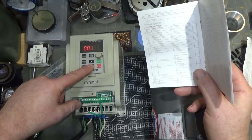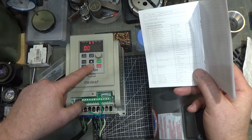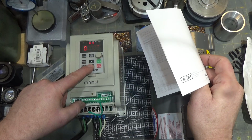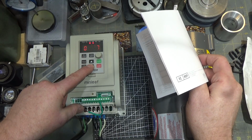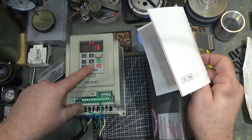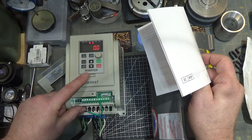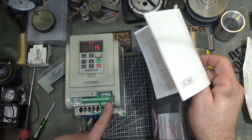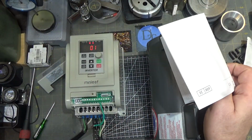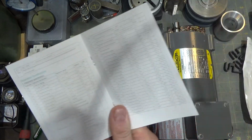It has a lot of programmability. It's got 6 button functions that are all programmable, as we talked about earlier. It has an analog in. This SP1 is the analog in on this guy, and that will allow you to set a potentiometer between common and the +5, or +12 rather, and you can set the speed control externally. So you could basically remote all these buttons externally if you want, and that's a nice feature as well.